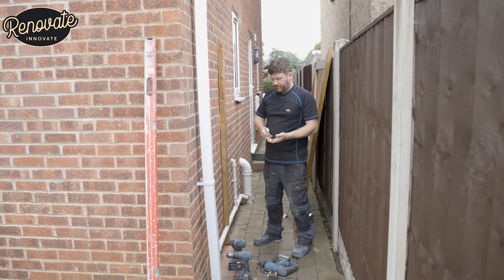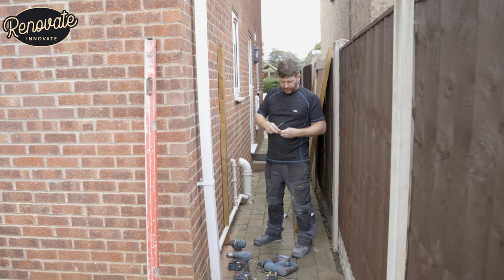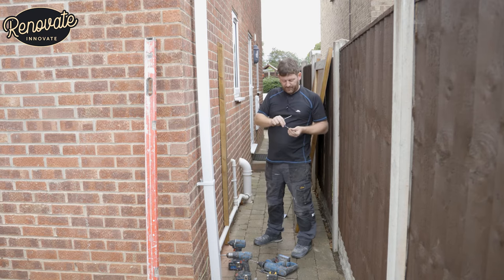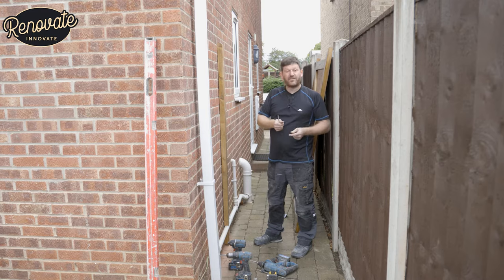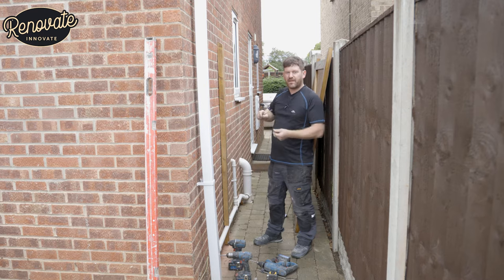So we've got our gate post on, we've got that plumbed in, we've got plenty of fixings in there. We've opted to use one of these concrete fixing screws with a star drive. If you are going to use them, make sure you've got a few star drive bits, especially using an impact driver because they've got a tendency just to take the ends off. It recommends using a 7mm hole for this one, but I want a 6.5mm hole just to make it a little bit tighter when it grips on there.